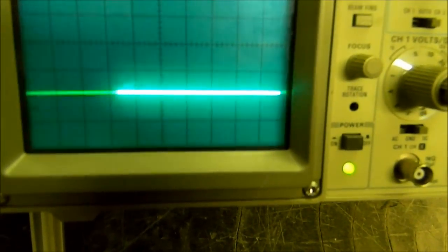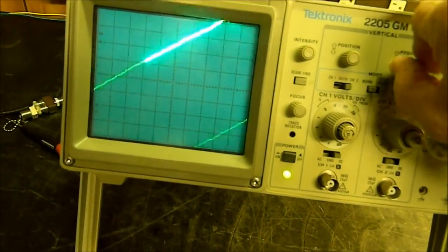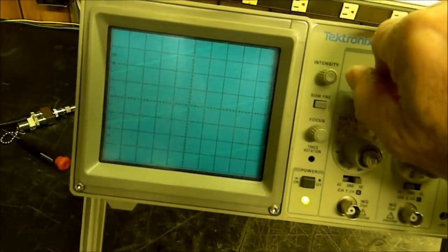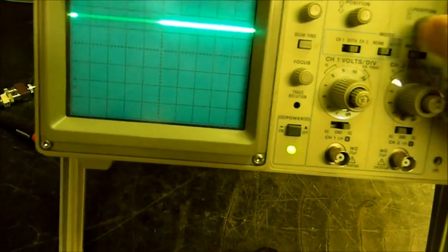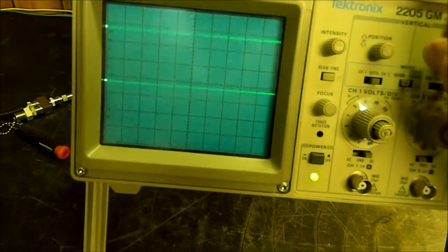That's alternate mode, and this is 'add' — you can't see much from just a trace running across. Let's put it back in channel one, go to channel two — there's channel two. Let's increase our sweep rate and exercise our knobs. See both at the same time — that's working. Run it from one extreme to the other to wipe the pots clean. Go back to channel one, do the same thing — both of our channels are working.